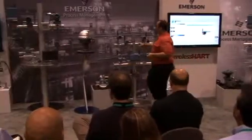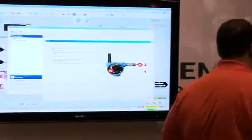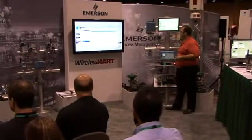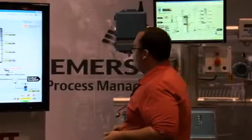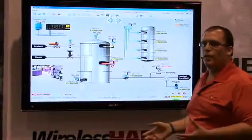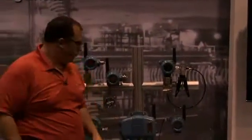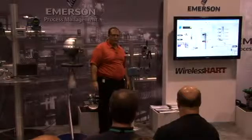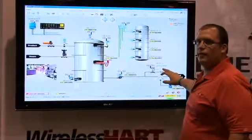We're going to go ahead and correct this problem — it's simply a temperature sensor with a switch that does the open/short on it. And we can see our problem went away; the process is operating correctly again, so we're going to close that down. Once again we have a well-working transmitter. Another example: on a process you might have sampling valves that, due to human error, get left open. You need to make sure everything is closed before starting the process, otherwise you could end up with a spillage or environmental issue. We can now determine that valves are open or closed using the new smart wireless valve monitoring position indicator. You should see on the screen that this went from red to closed — all done wirelessly.